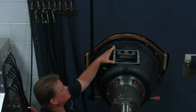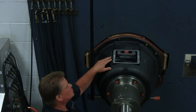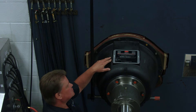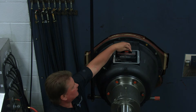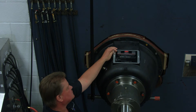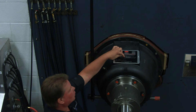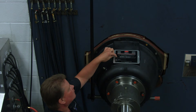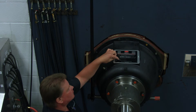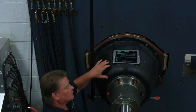Every twin-disc PTO comes with an identification tag that covers the hand hole opening for the adjustment of the clutch. On this tag is all the information you need for ordering parts, adjusting the clutch, and lubrication. It contains the model number, the BOM number — which gives us the list of parts used to build this PTO — the serial number, the foot-pound torque required to engage the clutch, the type of lubrication for the throw-out bearings and main bearings, and the time intervals to grease those locations. This is basically the story of each particular PTO.